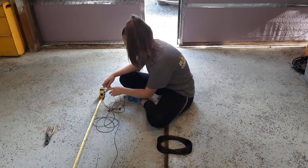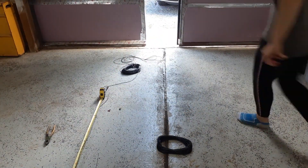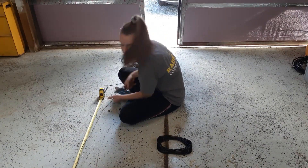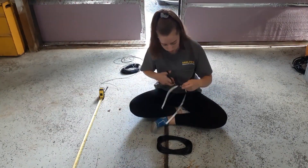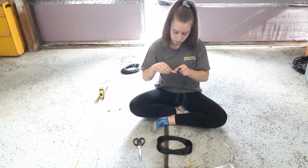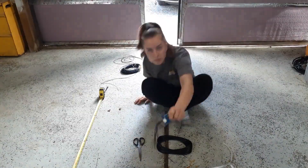Right now I am measuring out and cutting the 15 meter element. I did choose to do three elements on this: the 15 meter, because I never use 15 meters; the 20 meter, because I love doing POTA on 20 meters and also the DX is great — it is a DX Commander after all; and 40 meters, because I may or may not be guilty of operating 90% of the time on 40 meters.